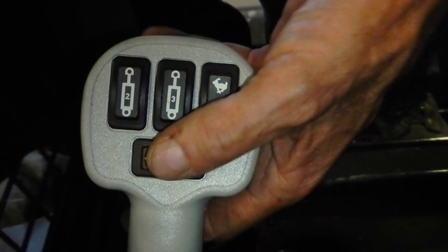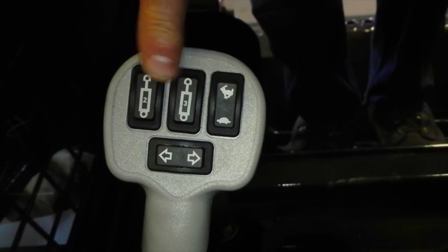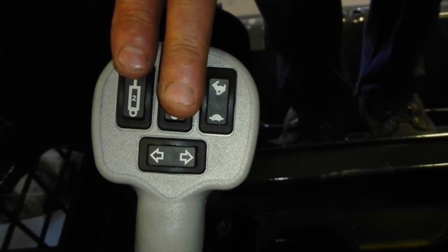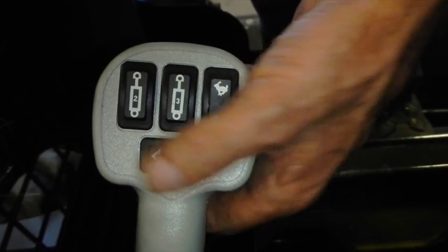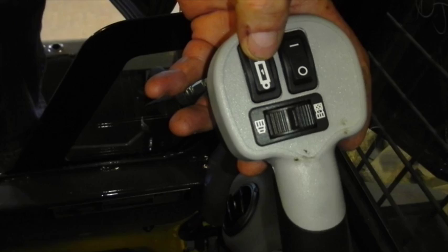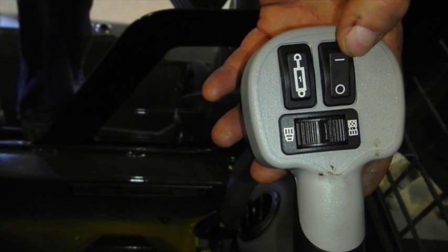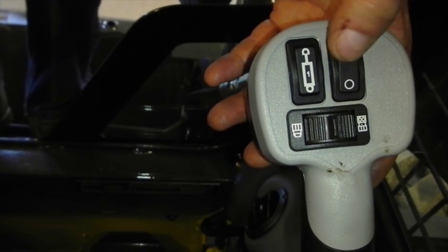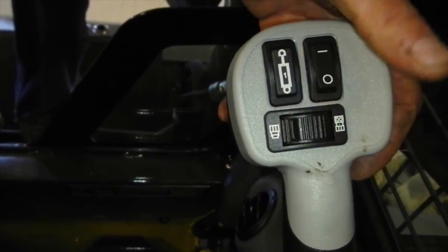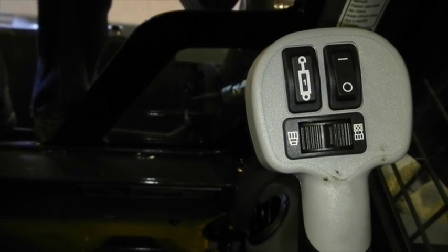On your left-hand control, we have a series of buttons. This is your two-speed button — your high and low. These two buttons, cylinder two and cylinder three, are for your 14-pin connector and are run just for that connector for your auxiliary hydraulics. The lower one with the arrows on it is your turn signals for right and left. On your other control, this is function number one for your 14-pin connector. This is the switch that turns the connector box on to activate all those other functions. This switch here is a variable switch or you can lock it on in either direction — that is for your remote hydraulics, whether it be high flow or standard flow, for all the functions out of that valve bank.